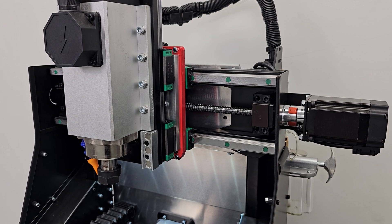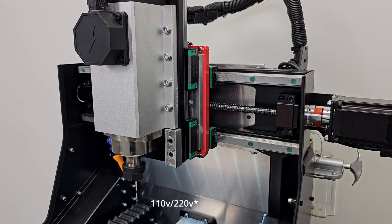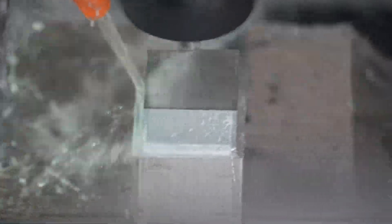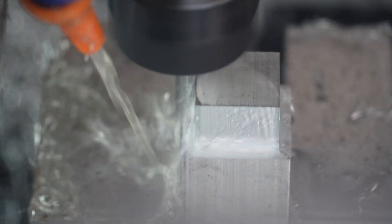The entire machine is available in either 110 volt or 220 volt spindle configurations. There is no difference in performance between these two variations, just less current draw. The entire machine on 110 volts will draw about 15 amps maximum under heavy cutting loads, and the 220 volt version will draw about 8 amps max.